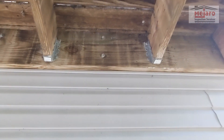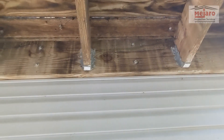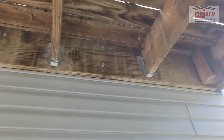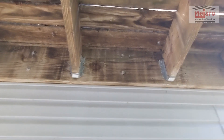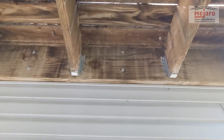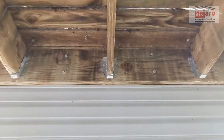They've tacked in a lot of nails or screws as well to hold it with that rim joist. But in this case, you want those to be done right so you actually evenly distribute that load on this backside. Ledgers are usually where decks fail the most — the most common place, at least.